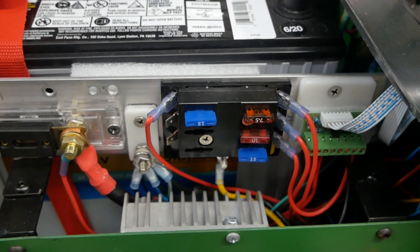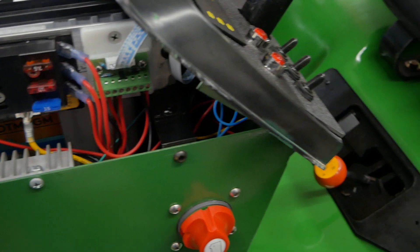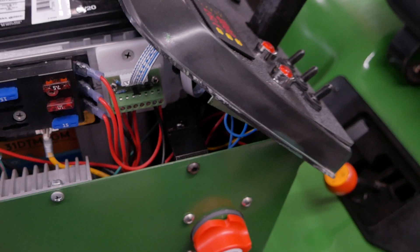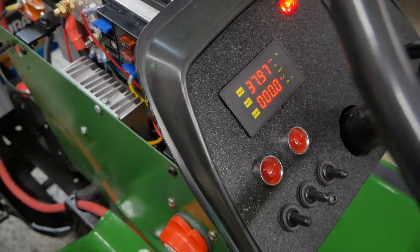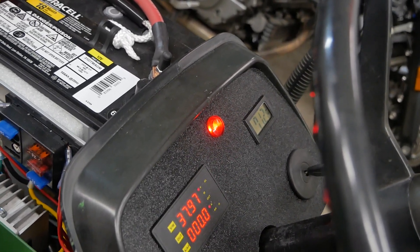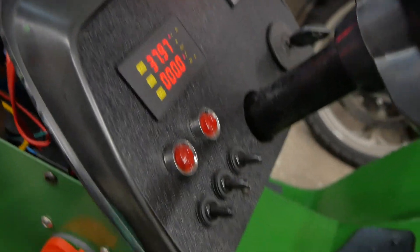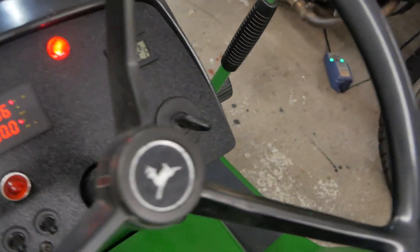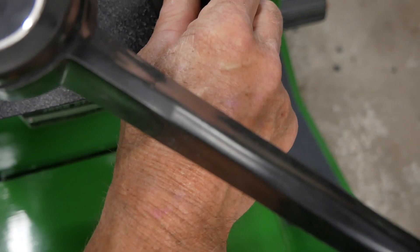So that's basically what's going on. When we want to run the tractor, the first thing we do is turn on the power. That activates the battery monitor system, and that big red light at the top illuminates telling me the tractor is ready to go — the electricity is turned on. Let's put it in neutral, and then it's just a simple matter of turning the key switch. I converted this key switch to operate the contactor.